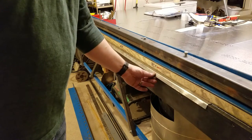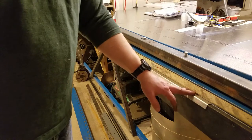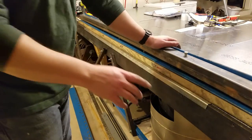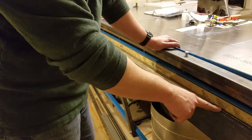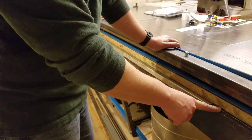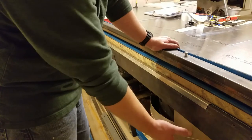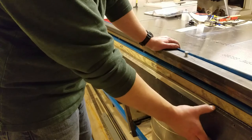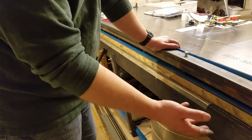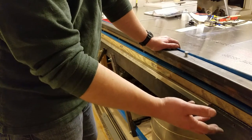I've taken the leverage helper off the front and I had to cheat a little bit. When I designed this brake I was originally looking for an upgrade — a half-inch slab of metal that I could use, and I wanted it wider, like 8 to 12 inches wide. What I ended up with is a 5/8 by 4 inch slab of metal. It was a piece of scrap so I went for it.